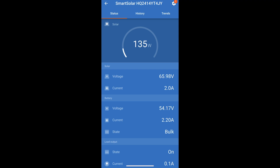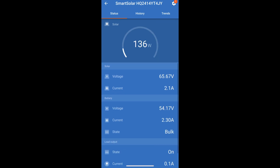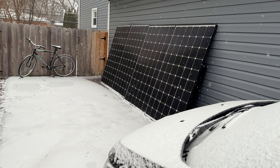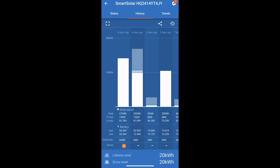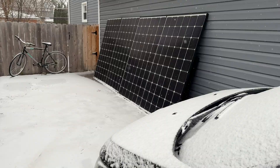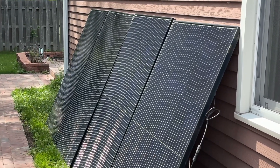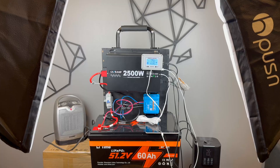The main limitation is of course the sun — if there's no sun, you're not charging. I wanted to show how four $30 solar panels can charge this battery, but the weather was rough: I got about 320 watt-hours the first day as it was cloudy all day, then it started snowing so we only got 270 watt-hours. With better solar panel placement and a full day of sun, we can easily charge this battery from 0 to 100% in one day.